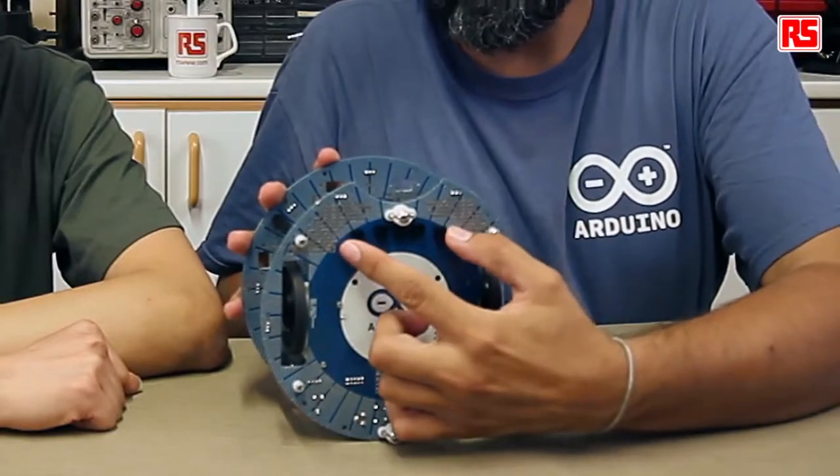There are five sensors here and they're coordinated with five LEDs up here that will show you when the robot sensors are activated or not. Those infrared sensors will be read by the top board in order to make decisions whether to take a turn in one direction or the other. Let's take a quick look practically at how this works.